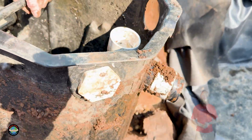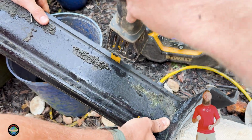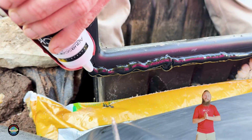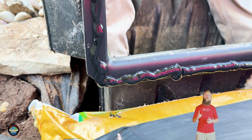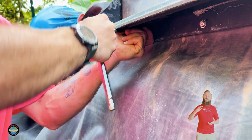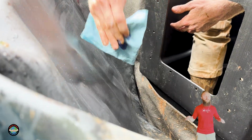All right, so as I promised you guys, these are the troubleshooting steps that we follow here at Modern Design Aquascaping to make sure that without lifting a single stone, we know where we need to allocate our energy in order to repair a leaking water feature. So step one, this is where we are going to fill the water feature up, and we are going to turn the water feature off. We're gonna make sure it's completely full, and we're gonna turn the pump off.